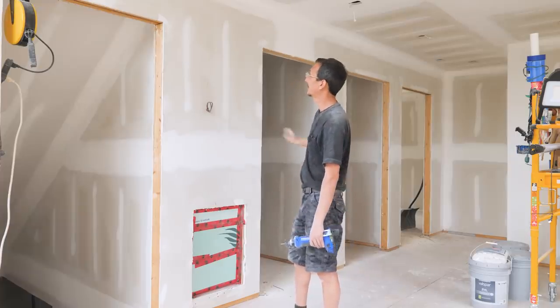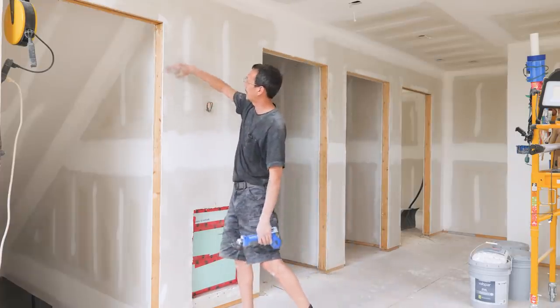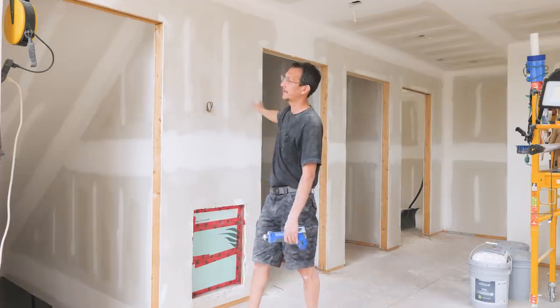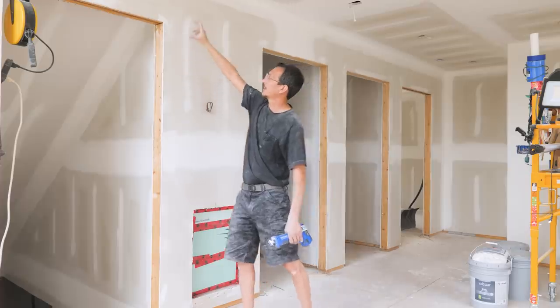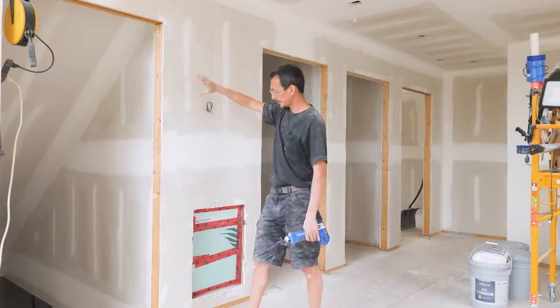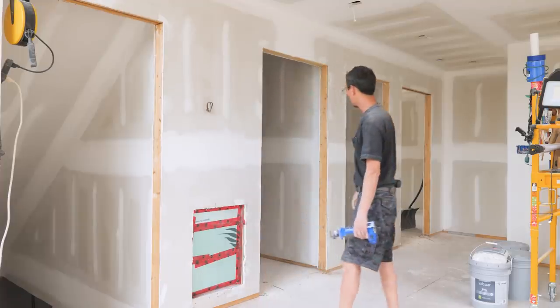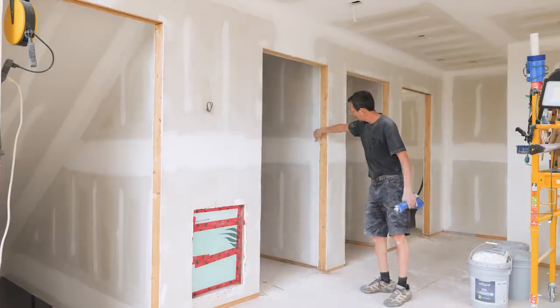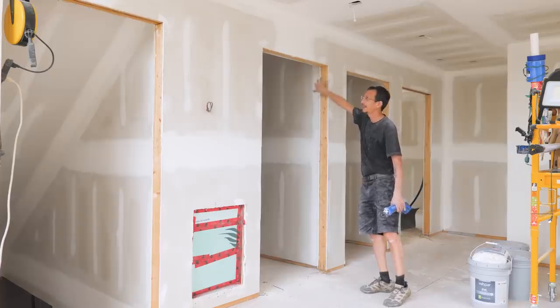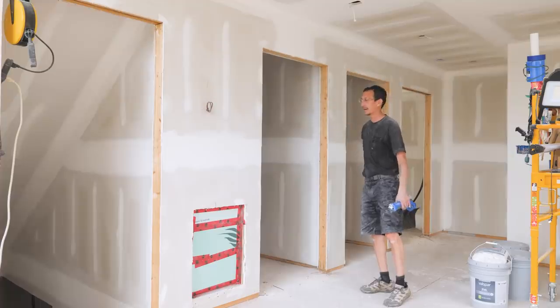So next, I'm going to go along and figure out what size casing I'm gonna put on each door. I mean, most of them are gonna get 4-inch. And then we'll do some sort of cool header casing at the top, but some areas are kind of cramped, like on the insides of doorways like this. You can't fit 4-inch casing in there, so you know there'll be like a 2.5 to a 3, and then we'll have to blend it and make it look right on the inside.